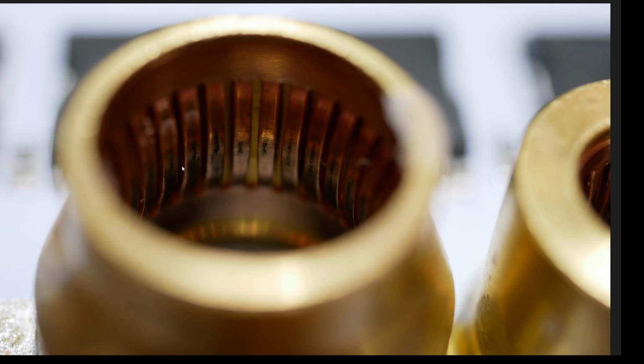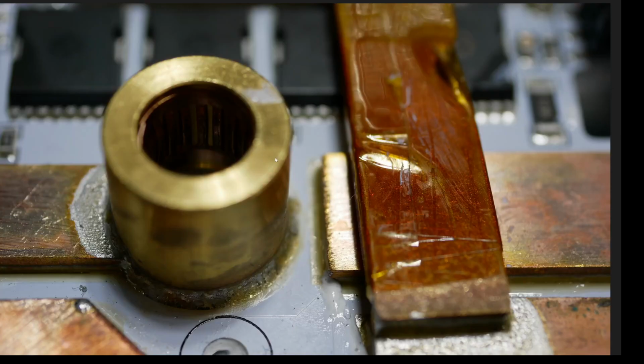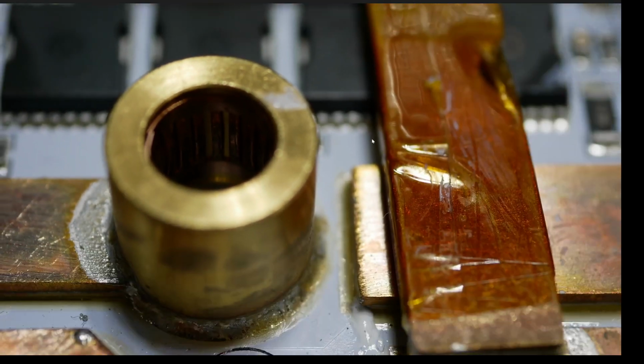These fingers got really, really hot. And most likely, that's because the power stage is shorted out. They literally blew up. And these connectors got super hot, and that's why there's scorching on here, and that's why there's the discoloration. And that also explains why it is in that other one. And I'll go grab that picture again. That also explains why those are so ragged and so scorched, because this power stage was a dead short. I mean, it suffered something really, really bad to do that to the fingers.